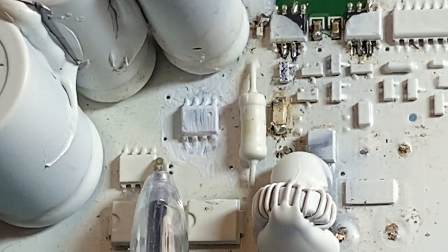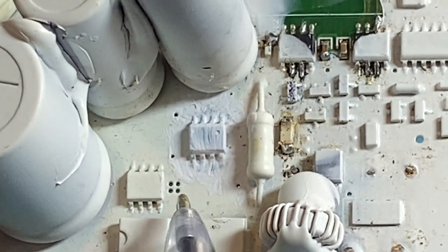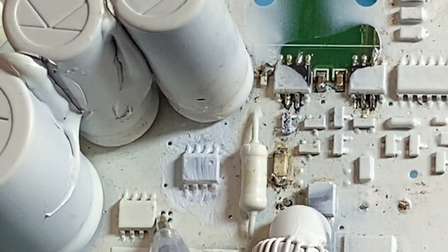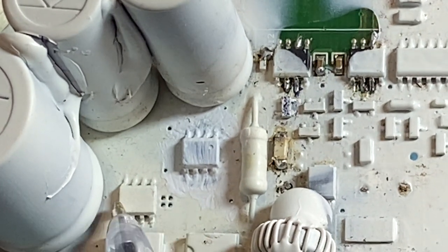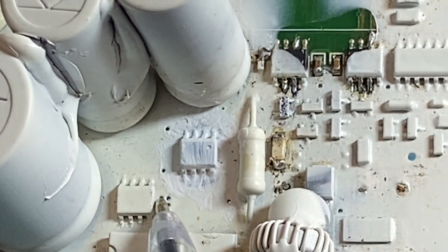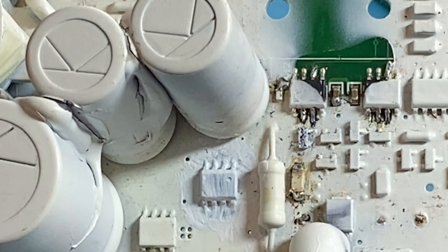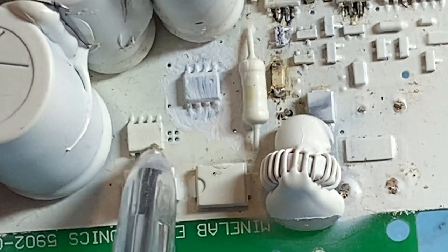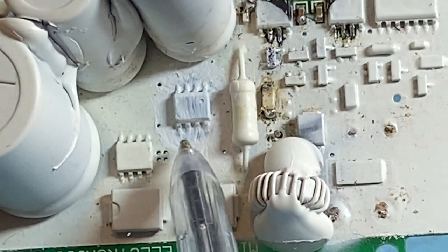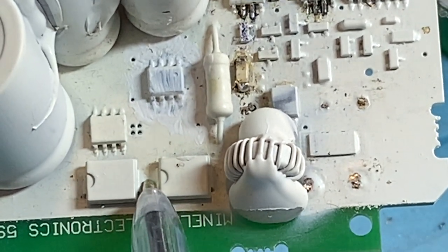It has a solderable pad area under the IC, which is part of the IC, and that actually soldered to the board, probably through a thermal process, maybe infrared. I don't know if it's done through a reflow oven. And yeah, normally the pads here on the IC, these go nowhere, but internally they're connected to the pad underneath. And you'll have one of these go to the junction of these two diodes here, and the other one will go under here.